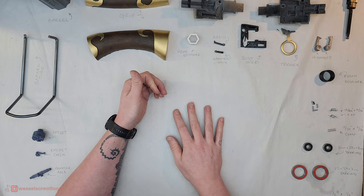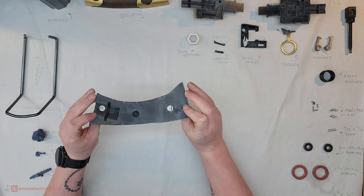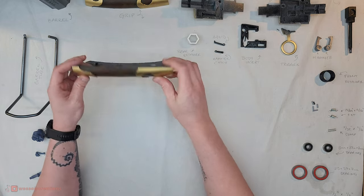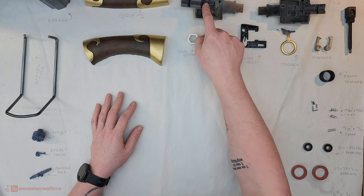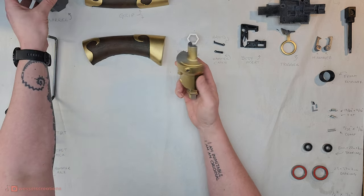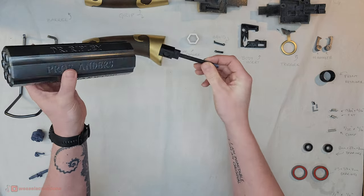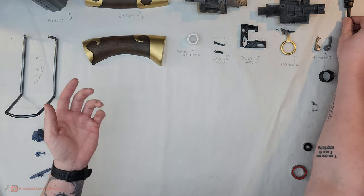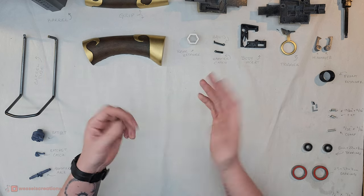In total there are 12 places for magnets — two, four, and then these each have three which is six, and then two more. I've used about 10. That's the overall idea of how to print it and where you need to watch out for certain tolerances. A lot of these things are going to need sanding and fine-tuning. Any really important face that meets another face — like the way this mounts and registers — I decided to go slightly big and sand back to it. That allows more flexibility across different printers, so you can find really nice fits without reprinting 900 times.